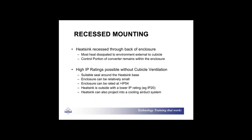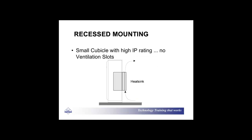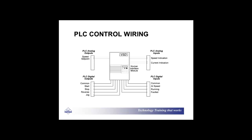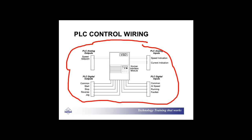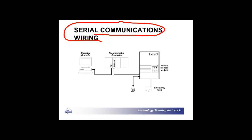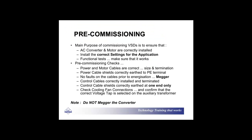What I'd like to look at is the issues of the PLC control wiring. There's a diagram here showing the different ways of wiring your variable speed drive. This approach has probably been replaced to a large extent by serial communications wiring. In most cases you've got your variable speed drive connected through to the PLC, using protocols such as Modbus, DeviceNet, or Profibus, rather than RS-232 or RS-485 on its own.